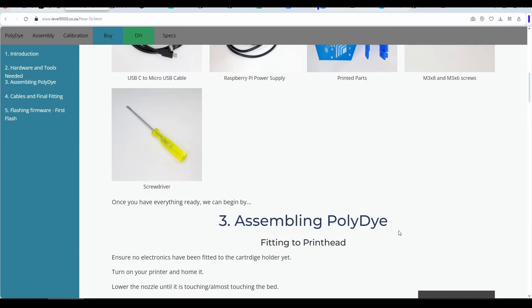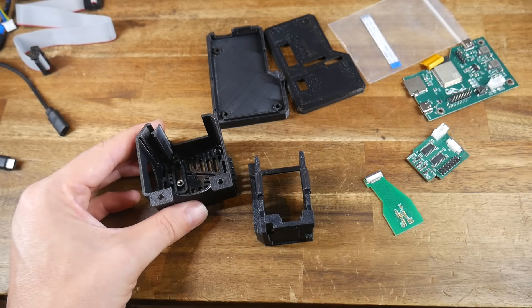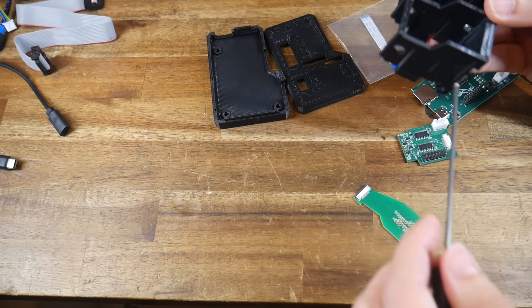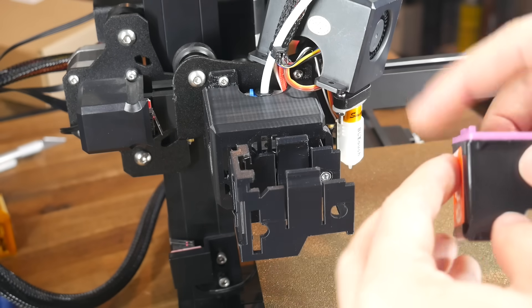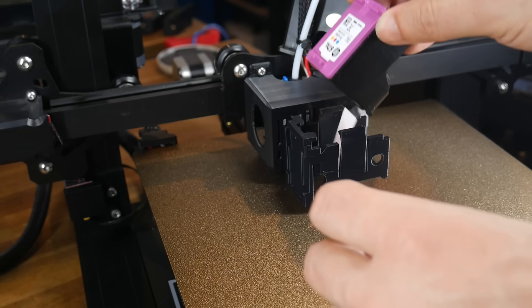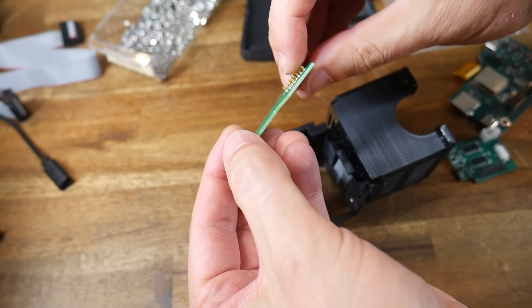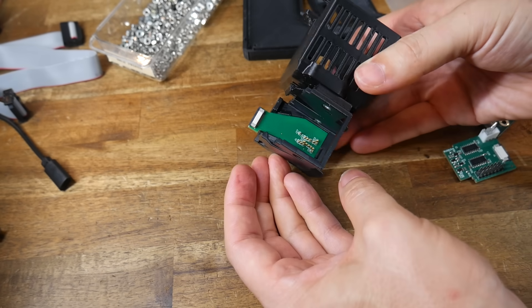I was able to design a new fan shroud, printed with the slots necessary for mounting the ink cartridge. I also replaced the plastic part that holds the X end stop, extending it upwards with holes to match the main Polydye PCB. After removing support material, I could put everything together. We start by inserting some M3 nuts into the slots in the back of our shroud mount. M3 bolts then go through the holes in the inkjet cartridge holder and screw into those captive nuts — we don't tighten these yet because we need to do some adjustment. I temporarily installed the shroud mount onto the printer and then inserted the ink cartridge, still with its protective film on.